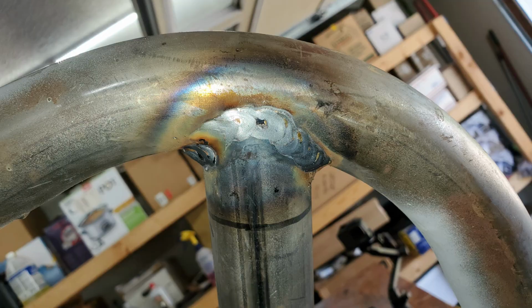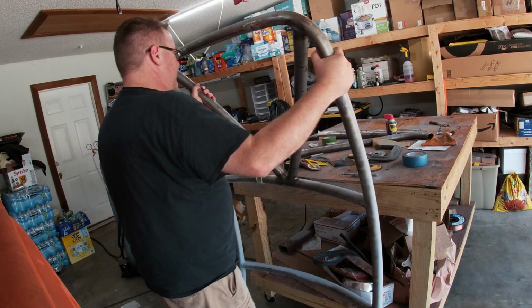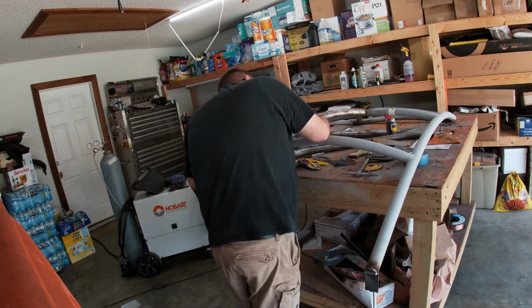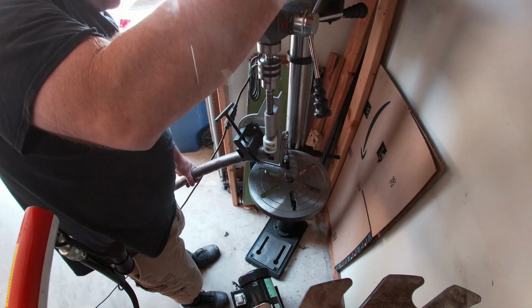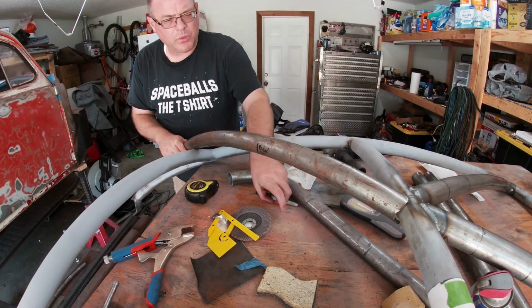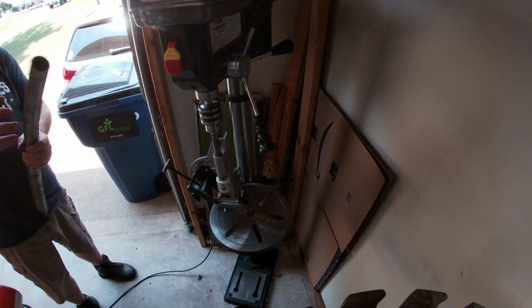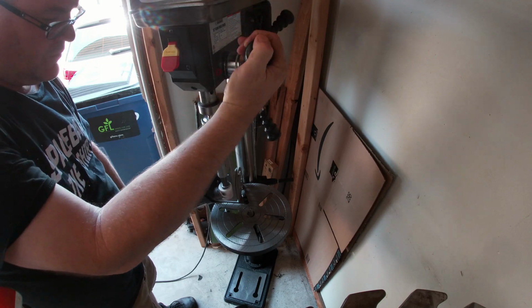Not too bad on the welds, but I'll get better as the build goes on. Next, it was time to do the diagonals between the B pillar crossbar and the C pillar crossbar. I could have just simply landed the tubes in the corners like I did the A pillar, but instead I decided to keep the diagonals in line with the front bars to make a nice clean look. This will mean some more tubes, little shorty tubes in the back to tie everything together, but I think it'll look better. And having more tubes isn't necessarily a bad thing.